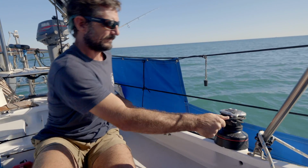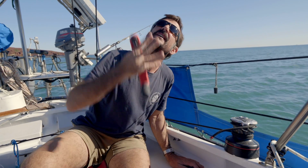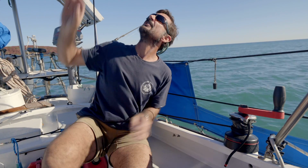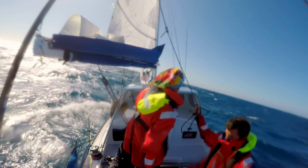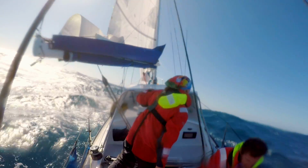We can put it on and we can just pull it by hand if we want. But if we can see a little bit of flexing happening in the mast, then it's neither here nor there, just to pop a little bit of extra tension on. The reason why we put this in is Clansman is just a sloop, but we wanted to put in an inner forestay so we can run a heavy storm sail. We did use that coming across from Tasmania to mainland Australia, and we haven't used it since.